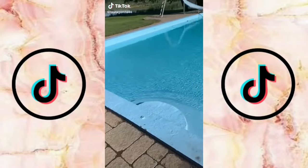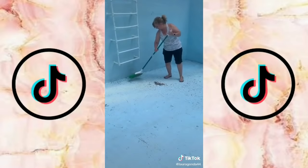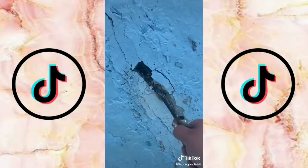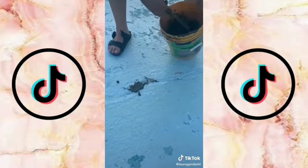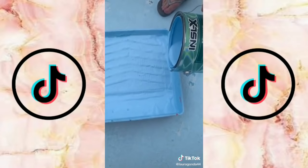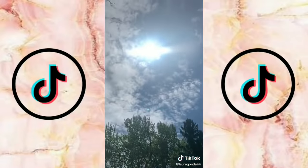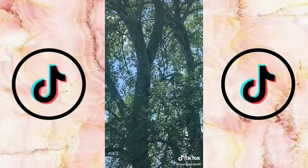My grandparents have this 80-year-old massive pool — my grandparents and my family all live there, and every year it takes so much work. First we sweep it out, then power wash the whole thing to blow out loose cracks and wash away the scum, then sweep again. We go through with a screwdriver to pull up loose pieces the power washer didn't get, sweep again, then patch all the big cracks with a hydraulic mixture. Let that dry, paint the patches with special swimming pool paint, then paint the entire pool — floor, walls, and top ends. It was 85 degrees this day and we were dying, and of course the cottonwood tree decided to shed today — that's what the snow is. Finally it's painted and ready to fill.